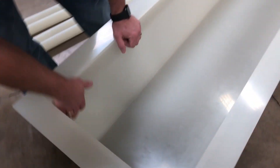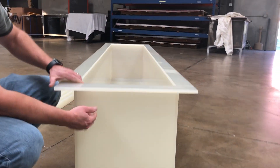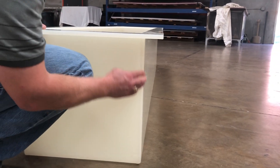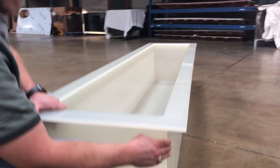We have full penetration of the sheets — they're beveled and then fully welded. On the outside as well, it's beautifully welded and nice and smooth on the outside, so there's no way for that weld to grip or pull off.